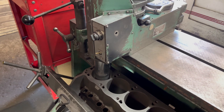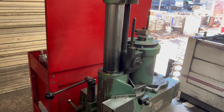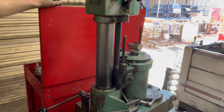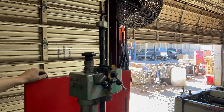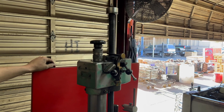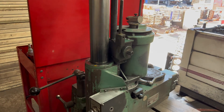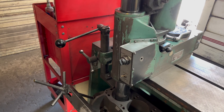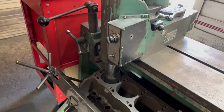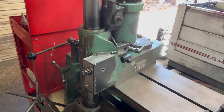In our production, we like to do maybe several Ford motors like this, then change it all over and do several Chevy motors. It doesn't take much to change from one to the other — we'll put in a different motor setup. But I'm sure if you're set up for a certain type of block, it's nice to run them all through for a while. Usually you can bore a motor in about 30 minutes.